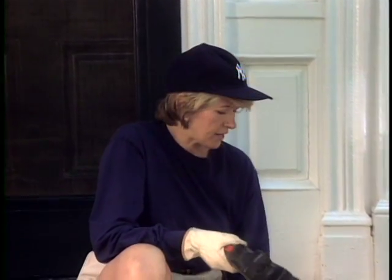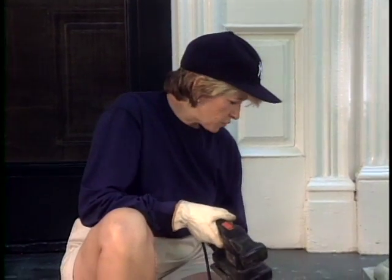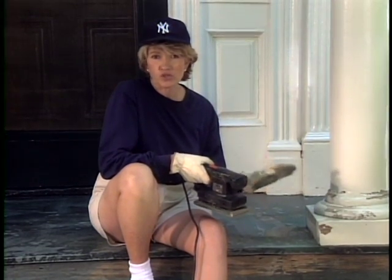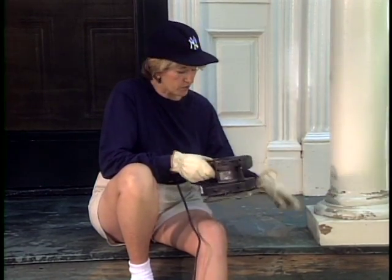This is a great little finishing sander. It's electric, and you use about an 80-grade sandpaper after you do your scraping. This smooths out the surface sufficiently for the first coat of paint. You have to do the whole surface, though — make sure you don't miss any parts: the edges, the tops, the sides.